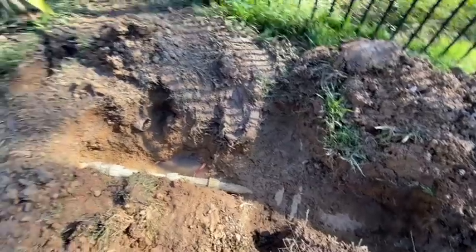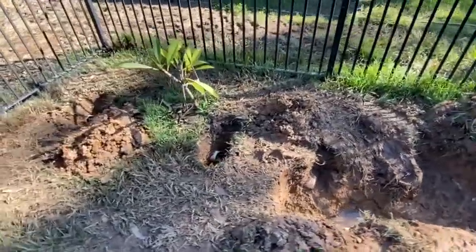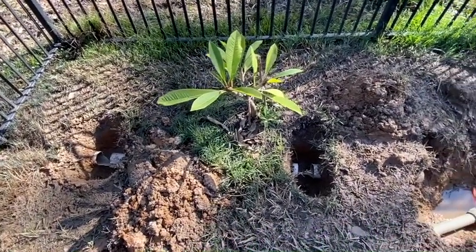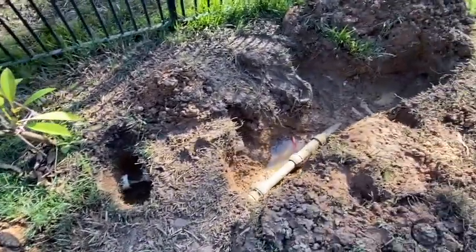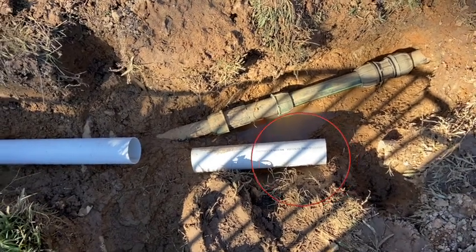To find the leak, I made the assumption that the leak is somewhere along this stormwater pipe. So I dug holes along it, put a break in the stormwater line at each hole, and ran the pump each time to narrow down where the leak was. I had to do a lot of pumping out of water as the ground was quite waterlogged — the water table was pretty high. Eventually I narrowed it down to this length here.